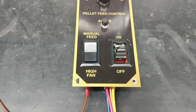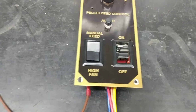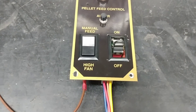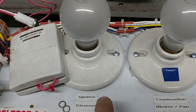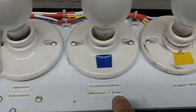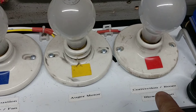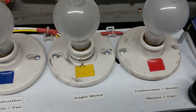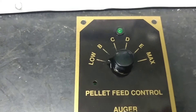I'll note one thing: this controller has a hot rod heater element to ignite the fire connected to it, so I've added my brown wire to my tester — my pell test — which means that my igniter will come on. I should be able to control the combustion fan, the auger motor itself, and the convection room fan, and change the setting from low to max.